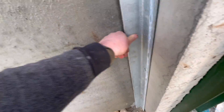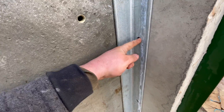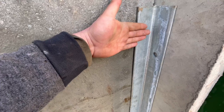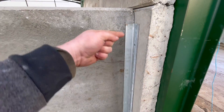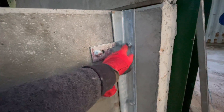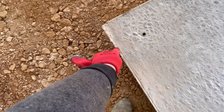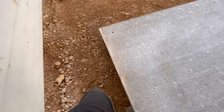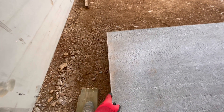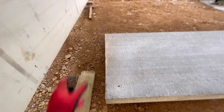We're currently putting the end panels in. That one bolts there like usual and then these corner bits have these big steel bars that go in here like that so they sit tight, then you drill four holes and they bolt there, and the usual cleats bolt on there like that. The same with the top ones as well — bar bolted in with ground anchor bolts, four of them, then just put the cleats on and they bolt straight onto that. This concrete panel just needs a sliver off there because it's got a slight imperfection — we're going to disc cut that bit off and then it'll fit perfectly in here.